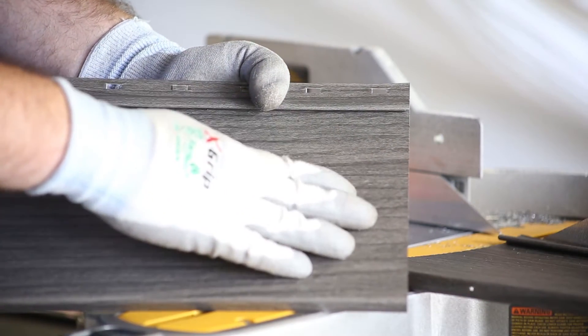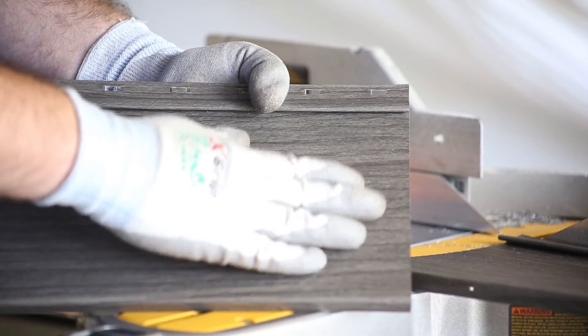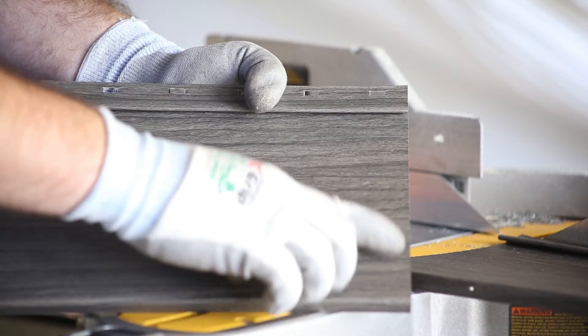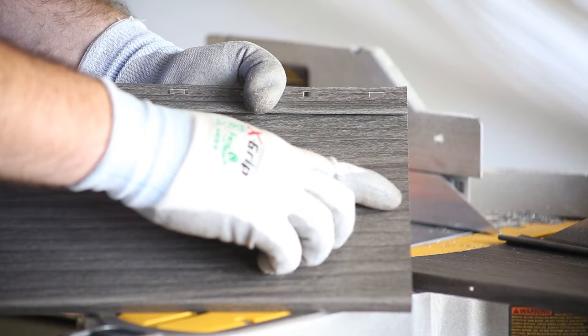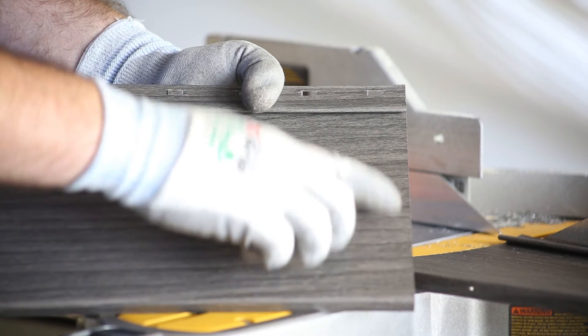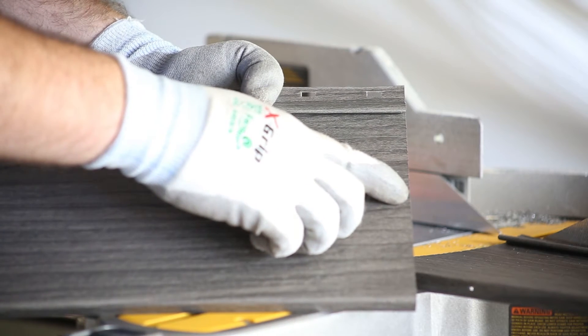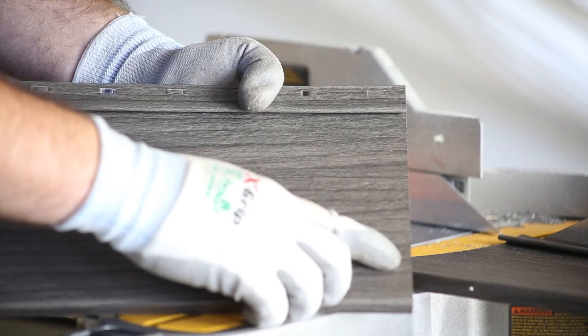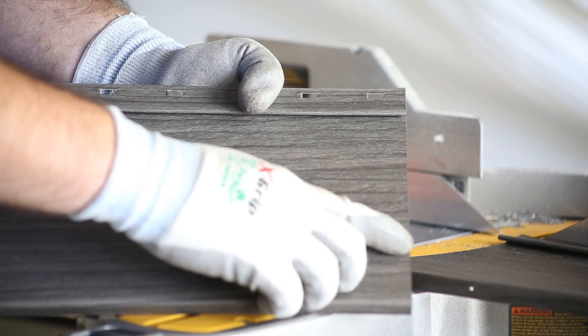One of the most important things to know when using a power tool to cut your painted steel: watch the edge and make sure you've got a good sharp blade throughout the job. When the blade starts to dull, you'll get heavy burning and burnishing of the paint — that means you're overheating the cut area and compromising the paint.